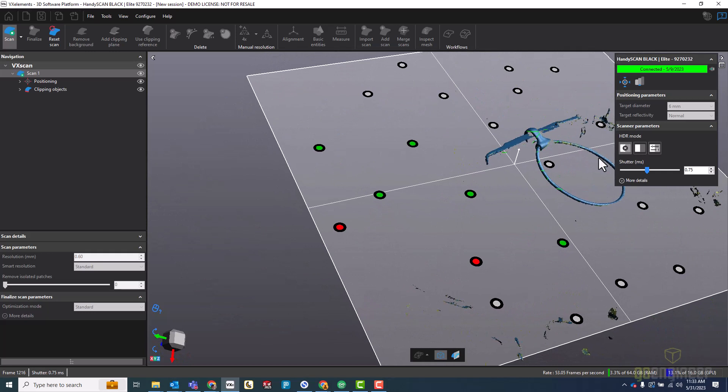So now we can fit the tweezers in, but there's nothing keeping them in there. My thought for that is to actually have a little arm that comes off the tip here, and then sort of presses on the back of the tweezers and uses a sort of living hinge to apply pressure. So to do that, I'm going to start a new sketch on the top plane.